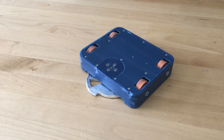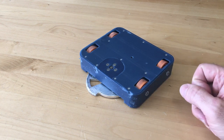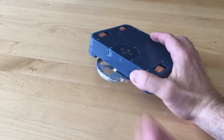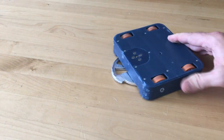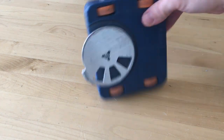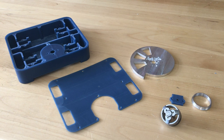Here's Blue Screen of Death — a little worse for wear after the DARK competition, but pretty compact. He's about 145 by 120 by 31 millimeters. It's an undercutter design, so this disc spins around and the wheels protrude above and below, so he can drive in this configuration. If he gets flipped over, he can also drive like that. He's machined from a solid chunk of glass-filled UHMW. There are a total of nine custom CNC parts and six unique parts.